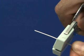To ensure proper stripping direction, make sure the arrow located on the head of the tool matches the intended stripping direction. Exerting a downward pressure and continually squeezing the handles gently, draw the tool in the direction of the indicating arrow, which will strip the buffer from the fiber.